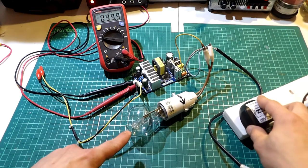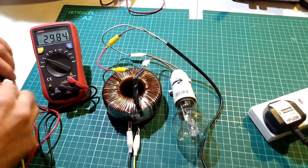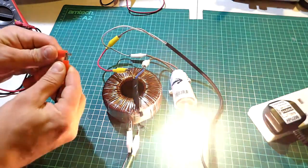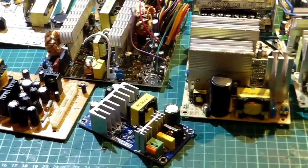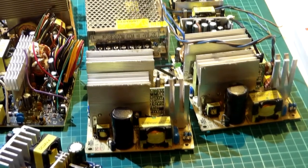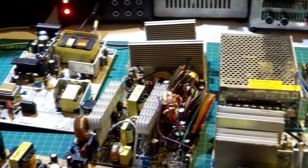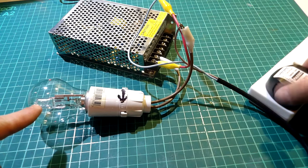The job of the lamp, apart from limiting the entire device, is to act as a safety indicator. If a problem occurs — for example if you have a transformer or a small SMPS with a leak or short circuit on the output — it will light up and signal a problem with the device. For an SMPS it will act a bit differently, because usually the short circuit protection will kick in by changing the on/off state of the transistor, or in short, the duty cycle.